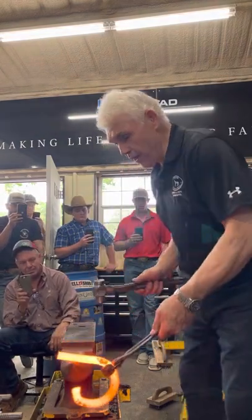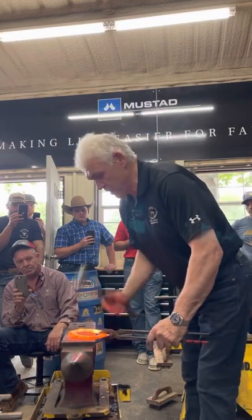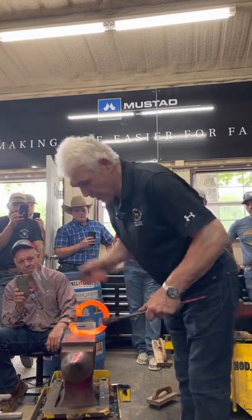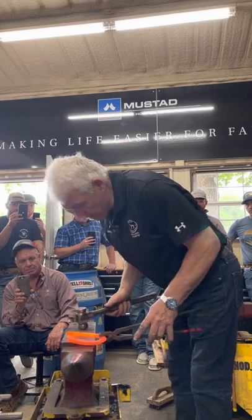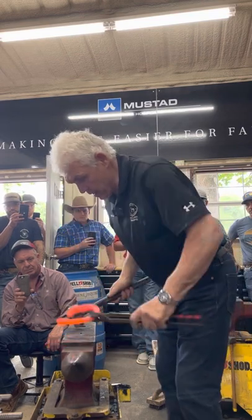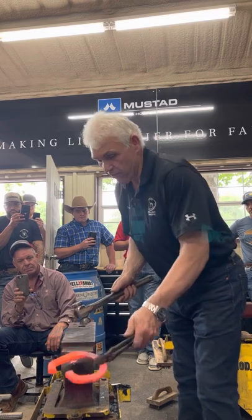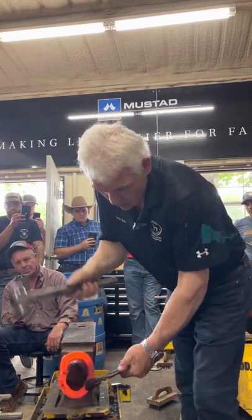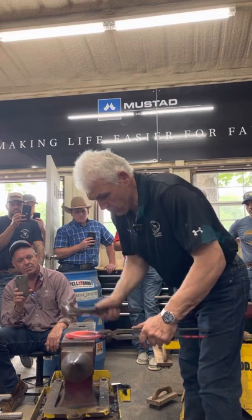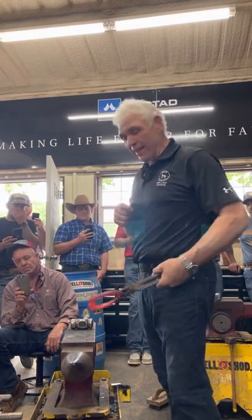Where are they facing? Where are the bars going to go? Look how easy it bends if you've got a good tongue position. Bend it 45 degrees. Drive it back, like a third. Knock the front corner off. Go a little square up. Scarf it. Left scarf on top of right scarf. Over again. It doesn't need a big overlap. I'm doing a short scarf and a welding.